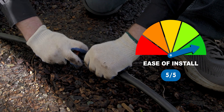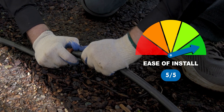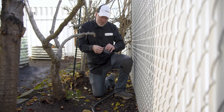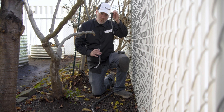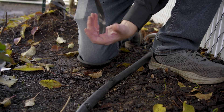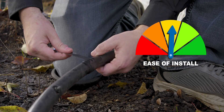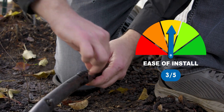The drawback is that although they are reusable, we found that sometimes it's tough to remove them. So while I do recommend them if you just want the easiest installation possible, I can't recommend drip lock if you plan to reuse them. Here we have some damaged three-quarter inch tubing. We brought a lot of half-inch repair couplings with us today, but that's obviously not going to do the trick on three-quarter inch tubing. So for this we're going to use repair tape. Take a strip off — it's perforated to make it easy. Remove the plastic and be very careful not to fold it back on itself or you'll waste a piece. Wrap it around the damage nice and tight; the tighter it is, the better the bond. Clean the tubing off a little so you don't have any debris, then start wrapping — hold it down with your fingers, pull it tight, and around we go. A permanent fix. I give repair tape a three out of five on ease of install. It is simple and intuitive once you get the hang of it, but placement of the tape is the most difficult part — it must be placed just right to make a good seal.